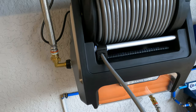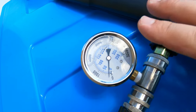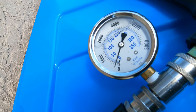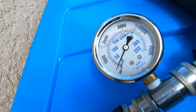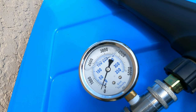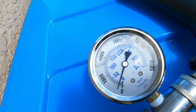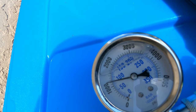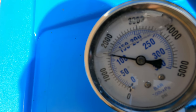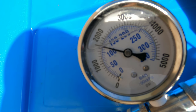The retraction seems to be working better than on my other unit. Now we'll check PSI. They say it's rated 2600 max — I doubt we'll get close to that. With the stock nozzles, I'm getting about 1700 PSI. These nozzles all have the same orifice — if I'm not mistaken it's a 1.8mm — so 25-degree or 15-degree doesn't matter for the PSI reading.